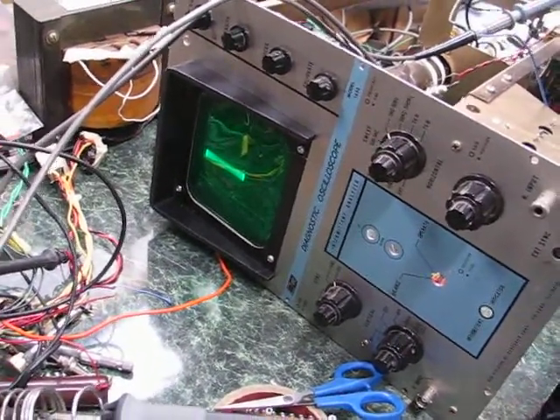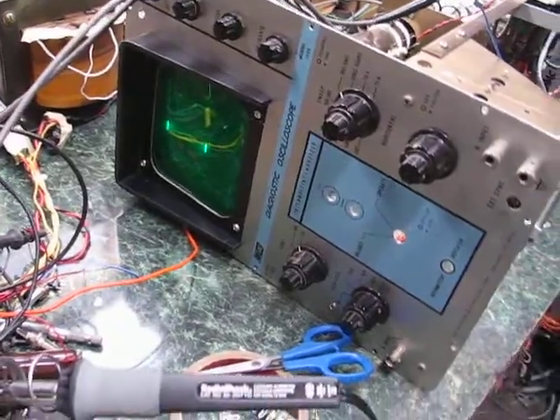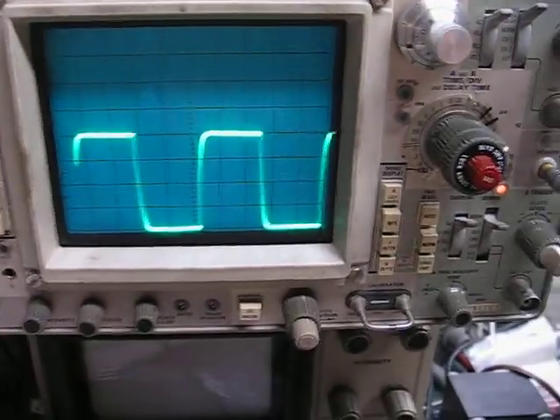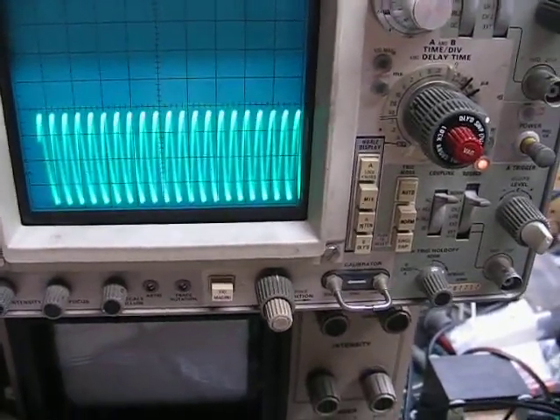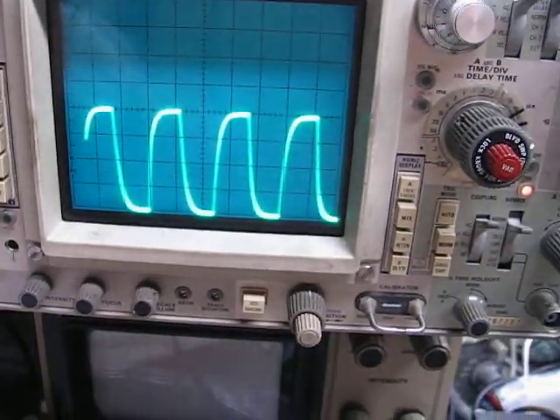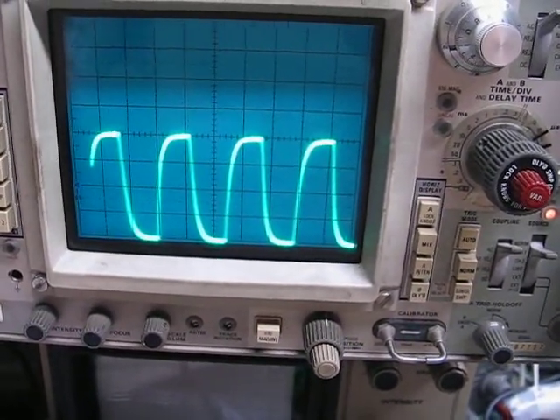Of course it's just a blur at higher frequency. I can turn it over to square wave and look at it on the oscilloscope, and you can see it doesn't have any compensation capacitors right now, so it's going pretty slow — that's a couple microseconds rise time.